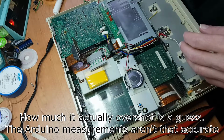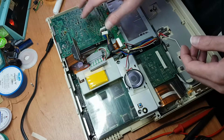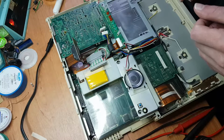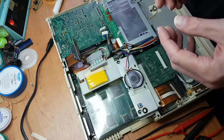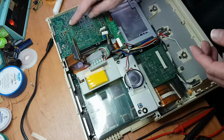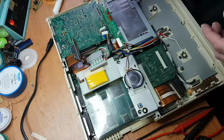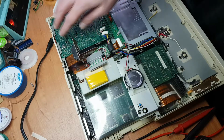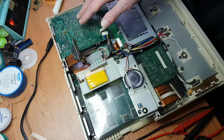And that's probably built into the microcontrollers to protect the rest of the computer from blowing up because of overvoltage. So it wasn't regulating properly, but I did see, using the logic analyzer, a PWM signal going to the 2 transistors, or the 4 transistors controlling it. And then I just used the schematic I created for the other power supply, and this part is completely identical, it's just in a different location on the board.